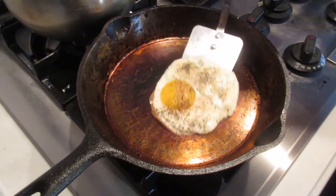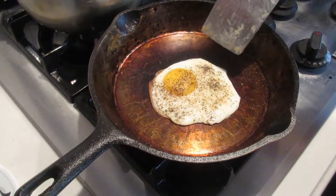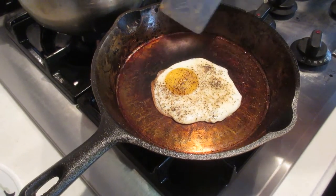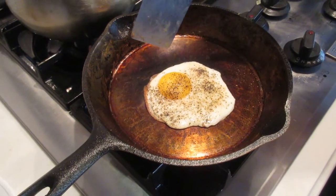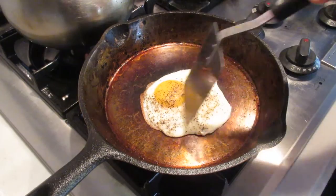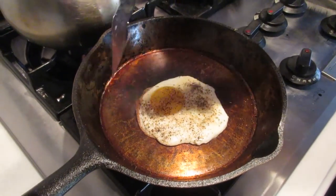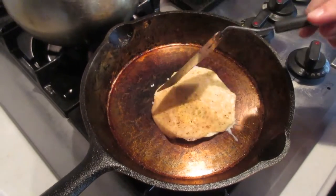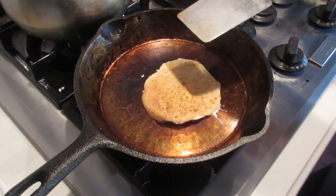So what I ended up doing is I took it out into the garage. With the tip of a file, I flattened the whole thing, and then I got the brilliant idea of taking the angle grinder and very gently, very flat, touched all of the surfaces in there, including the inside corners. And it's amazing how smooth this thing is now.